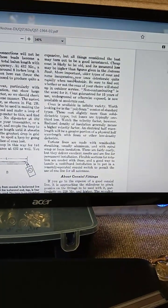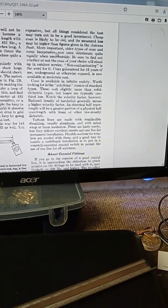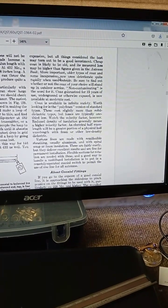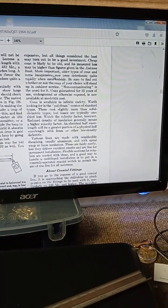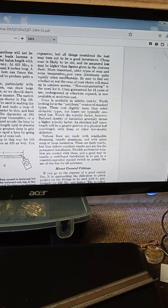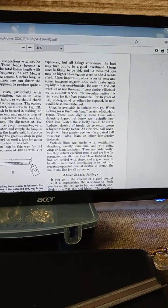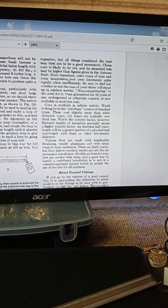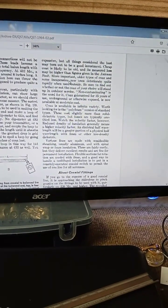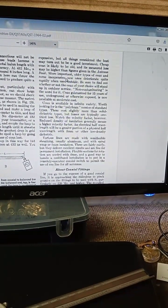What was just becoming a thing then is foam dielectric, the expanded EPS, expanded polystyrene, considerably less loss. The modern LMR 475 I use is somewhere around 0.3 dB in 100 feet at HF. It's so low they don't even rate it at times for microwave. If it's that important, get a gas-filled hard line. Is it that important? Really? We can't figure out to put the antenna closer and maybe put up some plate shielding? Put it right outside the ham shack and put up some shield plates.